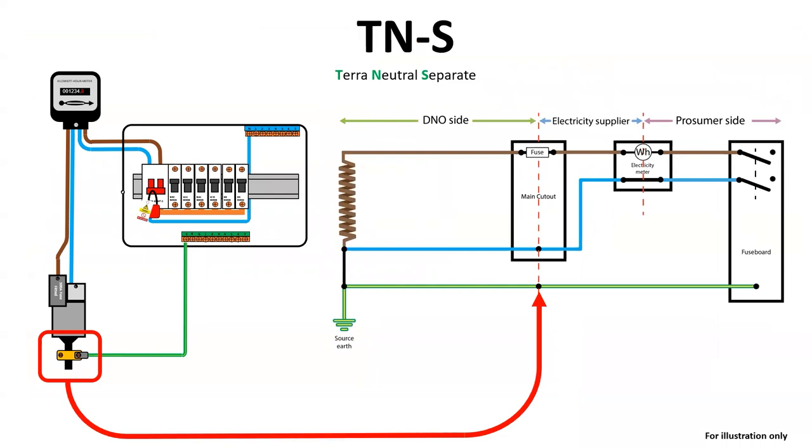If I show these illustrations side by side, you can see that the earthing conductor was terminated into the DNO's earth clamp. It could also be connected into an MET between the clamp and external to the consumer unit.